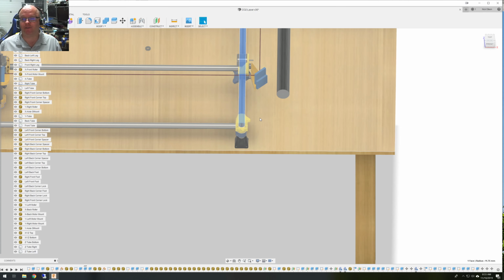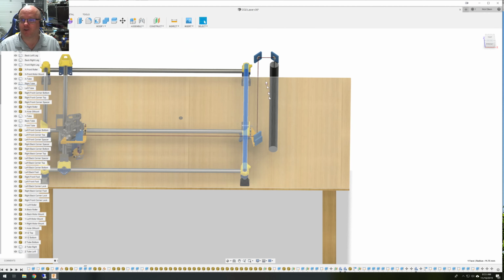And then you move the laser all the way as close as you can get it, and you watch to see if that mark moved. This is where having the spotting laser really kicked butt, because I didn't have to keep changing the tape because I was burning holes in it. I could actually just watch the spotting laser. The only thing you have to do with the spotting laser is dial in the thumb screws on the spotting laser so that it's following the current CO2 path. And once you get that fixed out of mirror 0, it'll follow the CO2 path from there forward. So you don't have to worry about where you move the other 3 mirrors. It'll always follow where the CO2 is going to go. And that made it really nice.